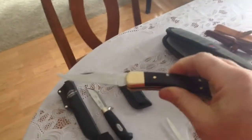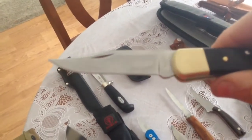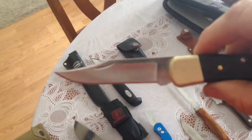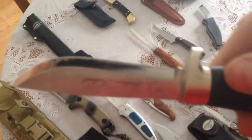This Buck 110 — I timed myself doing this yesterday. I reprofiled the blade a little bit, changed it to about a 19-degree bevel per side, so a 38-degree inclusive bevel, and then put about a 6-degree micro bevel on it. It took an hour to do this, and this was an easy one because it wasn't beat up. If you get one that somebody's really beaten up, it can take a long time. This one's really sharp — it has a Scandi grind on it.